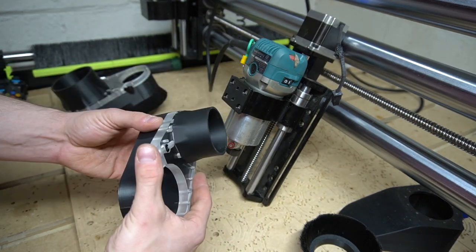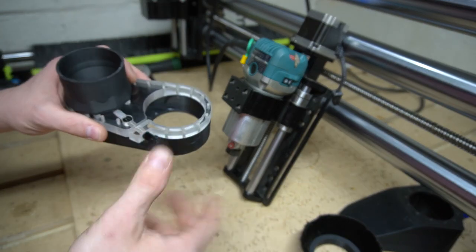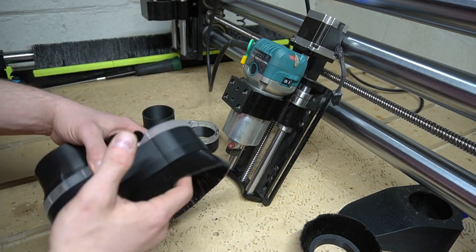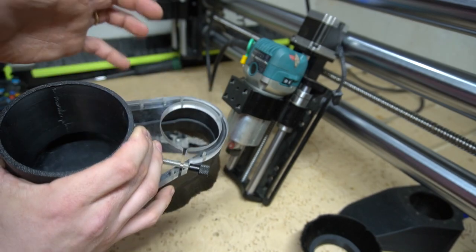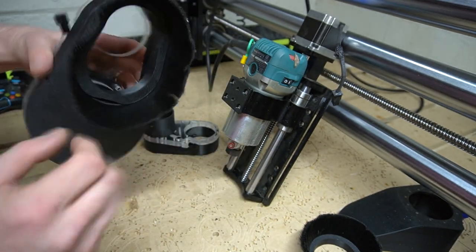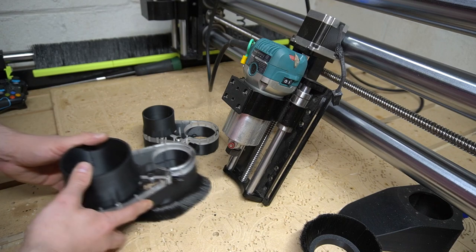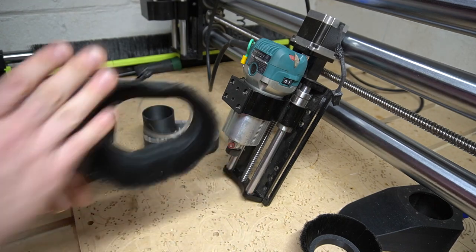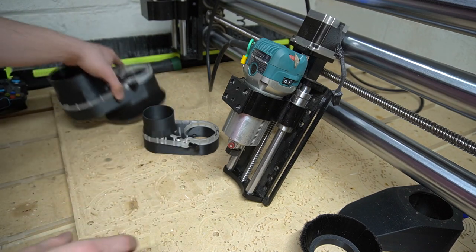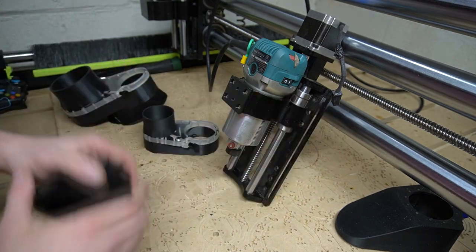I designed this dust boot really compact and small because dry vacs work a lot better when they're building up pressure and maintaining a constant flow — they're not just wide open. It's not like a dust collection system where a four-inch hose wants to stay four inches wide. That's why I've done this oblong shape. Also, my brushes all flare out, and there's a reason for that when you're using a surfacing bit — the brushes stay away from the bits and flare outward. I've never heard of anybody getting one stuck in the router bits. Even the four-inch version does that — they just flare out. That's how I designed those brushes.